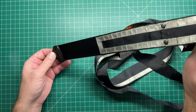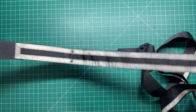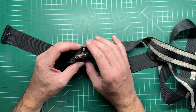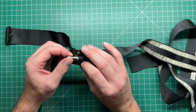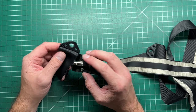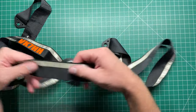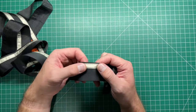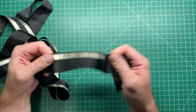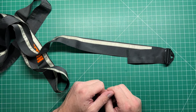You can put a little weight off the bottom and just hang it vertically. You could also hang it horizontally if you wanted to do some SSB work, strung between two points. The feed point here is 3D printed ABS, so it will handle hot sun for a long time, and the hooks on the top won't melt either. The woven tape is stitched into the material, and you can see that it's going to take a lot of flexing before it breaks — it's really, really strong.